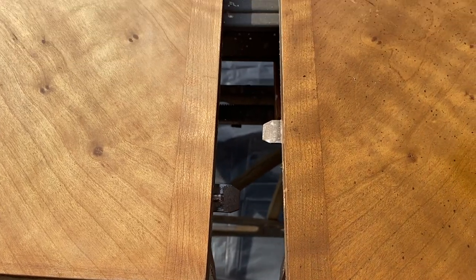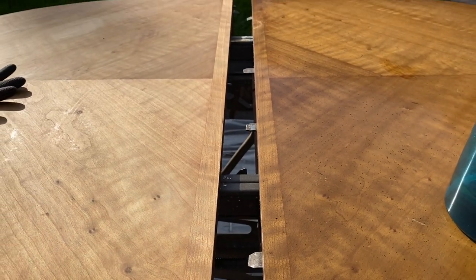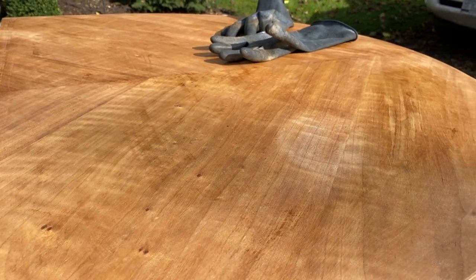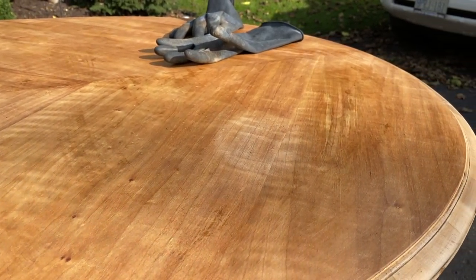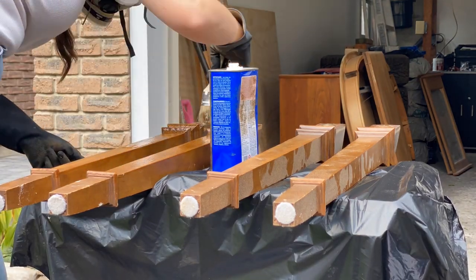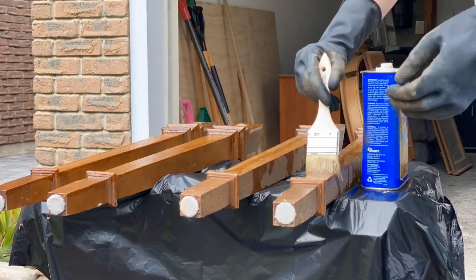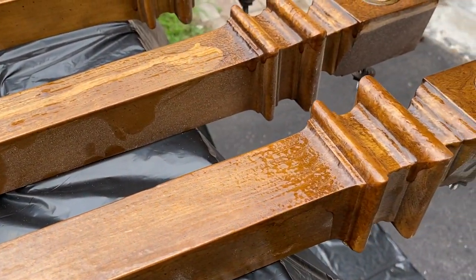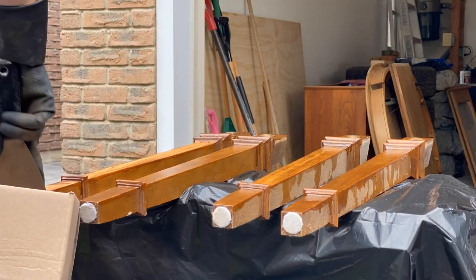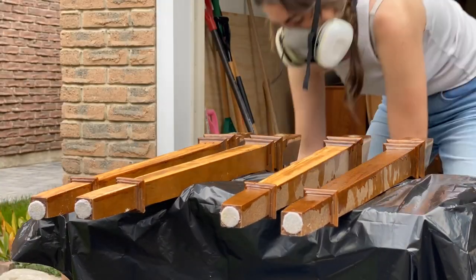As you can see here, the left side of the table has been stripped and the right side still has the original finish. It will require some additional sanding, but the effort saved in total sanding was definitely worth it to use the chemical stripper. Once I completed this process on the tabletop, I worked on other sections of the table one at a time, including the table skirting and the legs. This entire process is quite easy, but it does take some effort and some time, so I ended up doing the entire table over three different days, working in manageable sections at a time.